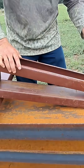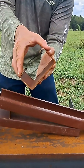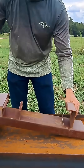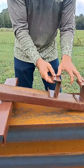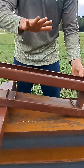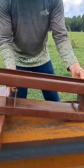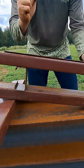Any beam is always at its strongest when it's straight up and down. The more it turns, the less strength it has, because you're no longer putting that load straight down on the vertical portion. So if you imagine this being your 2/12 pitch, all that load gets down on there — it's pulling down on the weld. You've got your clip sitting right here, and the weld is on this same side as the purlin, so you're pulling against it, constantly stretching against that weld.